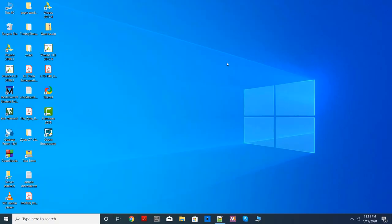Now, to do this, you need certain software. So when you install Vivado on your computer, actually 3 software packages get installed. One is Vivado, like this one, 2017.4, I guess that's the version you have. Another software is Vivado HLS, this one. And the third one is SDK, Software Development Kit. You'll be using the Vivado software when you use the PL part. Vivado HLS is used for converting C code into Verilog or VHDL. This semester we won't be using it. And SDK will be used for writing programs for the processor part.